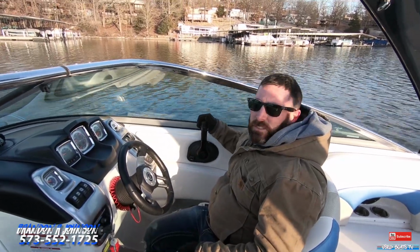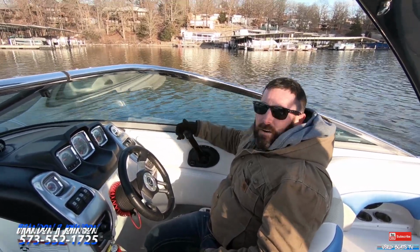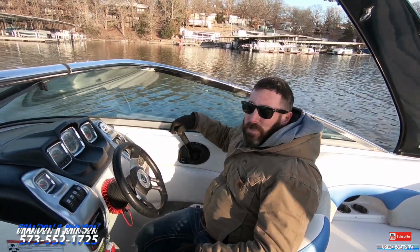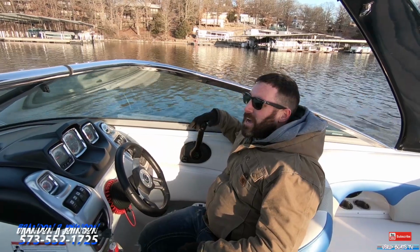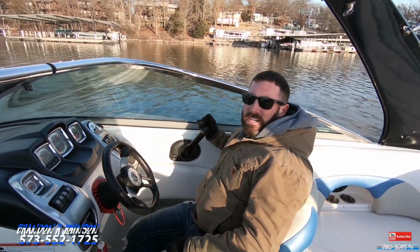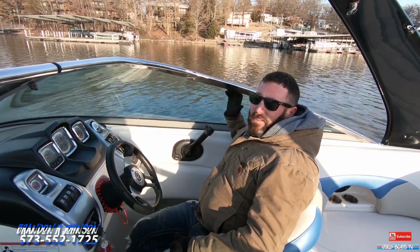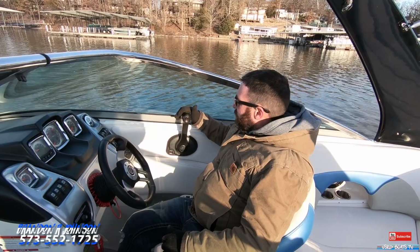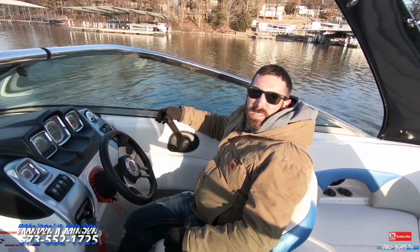Okay, shifting really smooth. There's a trigger right here that puts it into gear. There's definitive catch for forward. Your throttle range is beyond that. It makes it very easy to dock because you can't juice it. Now back to neutral. Again, you only push the button to engage it into gear. There's reverse. This thing shifts extremely smooth. Your throttle range is beyond that. Why would you throttle down in reverse? Because you almost hit something.